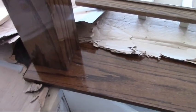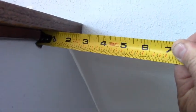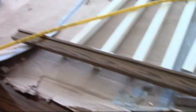I glued on a piece right there in that U on the newel post to make it look good — it's so perfectly done you might not even see it. Now I'm going to measure — I'd say about an inch and maybe an eighth. I walked to the other side and I have to make sure it is an inch and an eighth. Then I'm going to fasten this board down with a finishing nailer. Put in some finishing nails. Now we're going to put in that shoe rail that we cut to length right here.